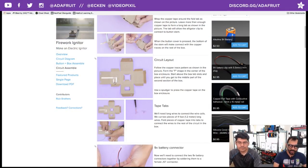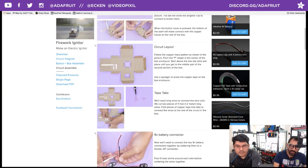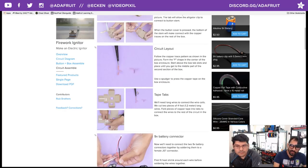For setting up the trace inside the box, you just want to create an F shape. The negative goes on the shorter one, positive on the longer one — you can flip it if you want. We're using little pieces of tape to create the tabs on the end where our wire extensions hook up. You could also solder directly to this — it works. Or just cut it out and make an alligator tab because it's a lot easier to connect with an alligator clip.